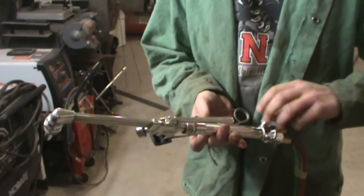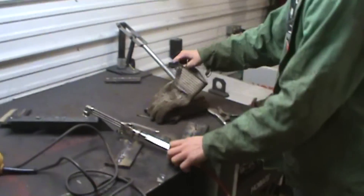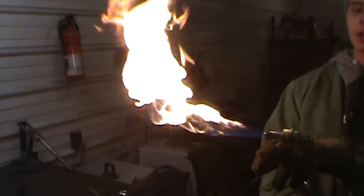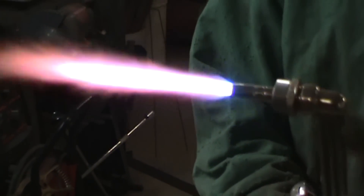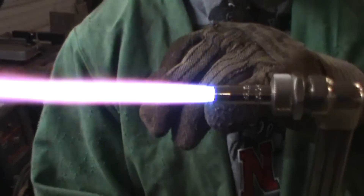I think a lot of people, whenever they say they don't like propane, it's because they're not using it right. I'll set up the tip to how someone would probably set it if they're used to running acetylene, and then how it's supposed to actually be set. Then we'll go ahead and make a cut so you can see the quality is comparable to acetylene. So we're going to open our oxygen all the way up. With that on full blast I'm going to get my gloves on. This is going to be a lot different — you don't get that sooty crack like acetylene. I'll turn it up a little bit. You see the flame coming out the end here — I need to turn that down so it's not jumping all the way out. Then add a little bit of oxygen. If someone was used to running acetylene, they're probably going to set this torch up something like that, and that's really not going to do you a whole lot of good. There's not enough gas flow to keep that flame out of the tip, and real quick that tip's going to get really hot.